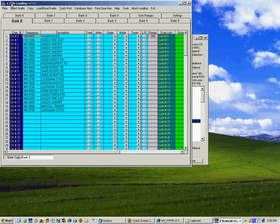There's a little counter and it counts up. If you look on the bottom of the radio you'll notice there are 10 small blocks — each one represents a completed 10 percent. Once this tracks over you'll notice two on the radio: one blinking and one full. This will track at the same speed as the radio is showing, and once this reaches 100 percent the radio will go back to saying Clone Mode just like before. Then all you have to do is pull the plug out of the side of the radio; it will initialize and normally say 'Programmed by ScanCat Lite,' and all the frequencies will now be in your radio. We'll continue this with other tutorials on how to merge files and answer more common questions on how to get things going with ScanCat Lite. We appreciate your business — on to the next tutorial.